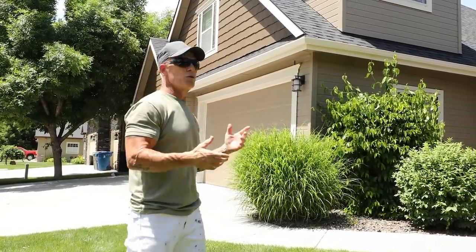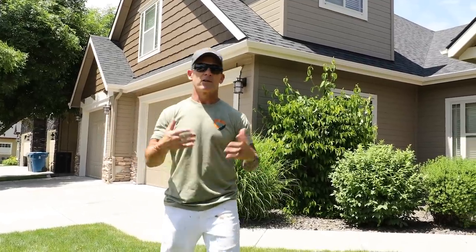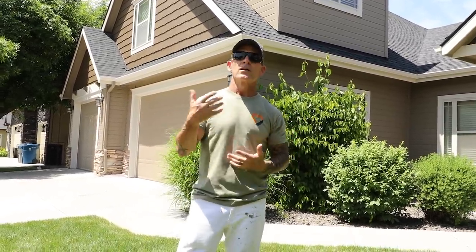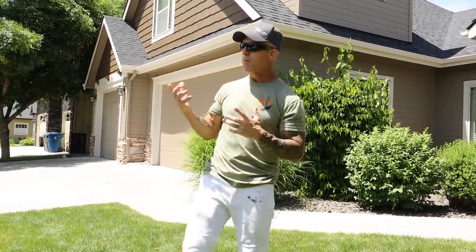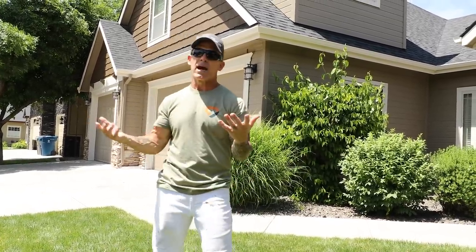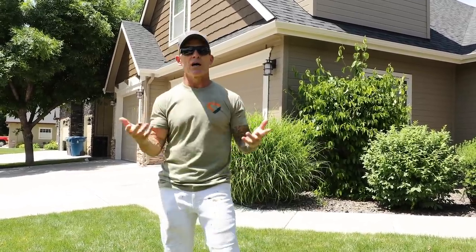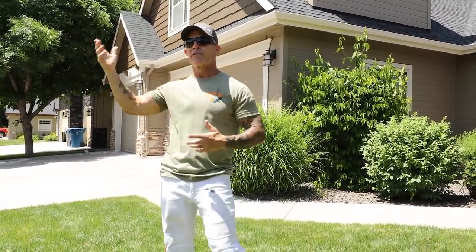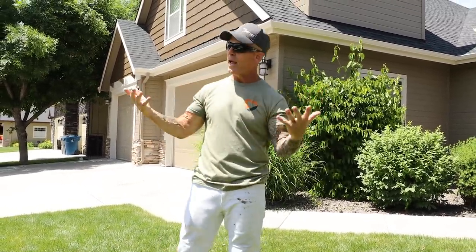When it comes to the painting process, I'll talk a little about tools and efficiency. It's best to invest in the proper tools to make painting quicker, more efficient, and more enjoyable. For instance, hand maskers — you don't want just one, because switching out paper and plastic takes a lot of time. Time is money as a professional painter, so you should have two hand maskers.